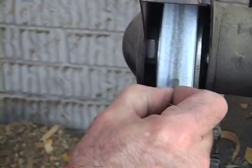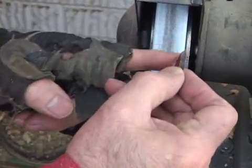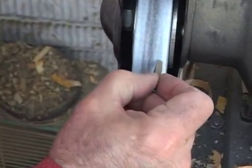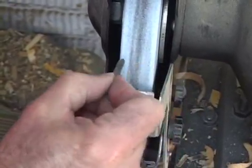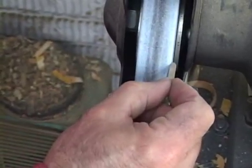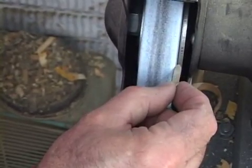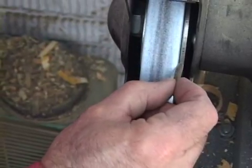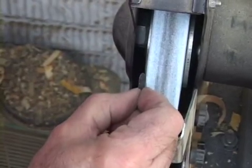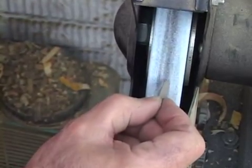I'm going to change the angle at the tip and line up the tip bevel so that the tip is going to be ground. When I come over to the side, I've radiused over a very small radius on both corners of this grinding wheel, so this is not a sharp corner anymore. I can twist and roll the cutter in my fingers to find the spot where the bevel lines up, and just dress the bevel along each side.